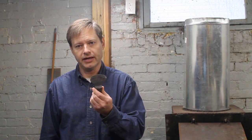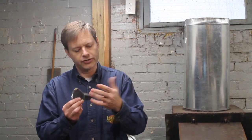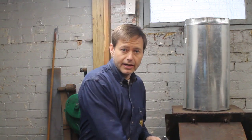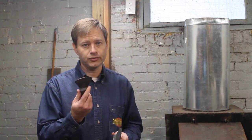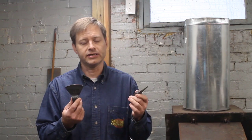I made a wedging hot cut hardy with the induction heater, but due to an error it ended up a little too small, so it gets relegated to my smaller anvil and I went ahead and made another one. This one turned out just right for the larger anvil. For comparison purposes, I used my coal forge to make this one and the induction heater to make this one. Let's see how it went.